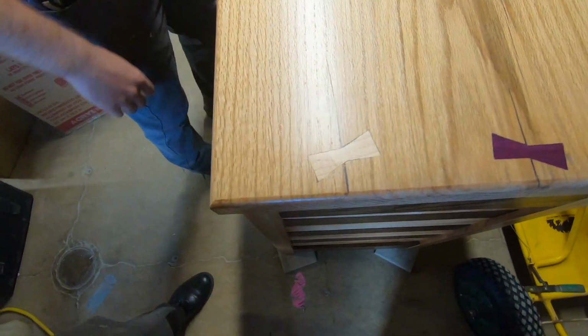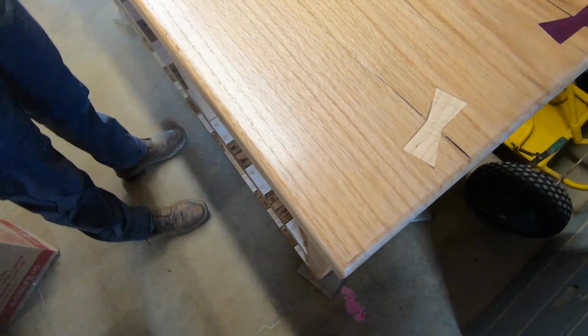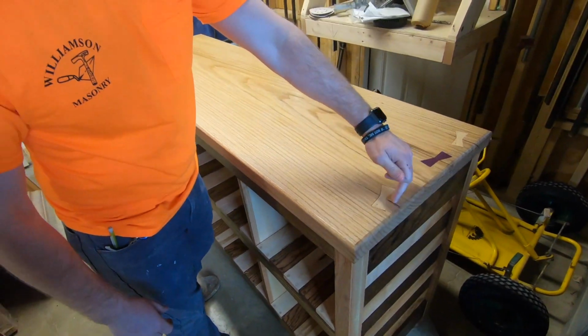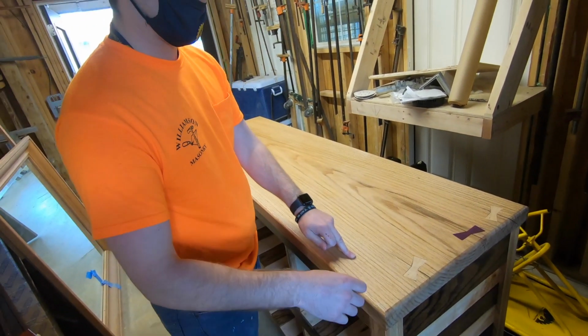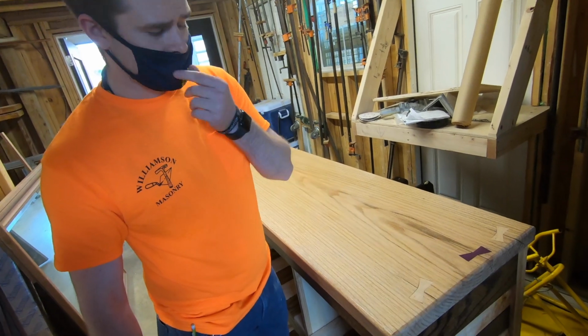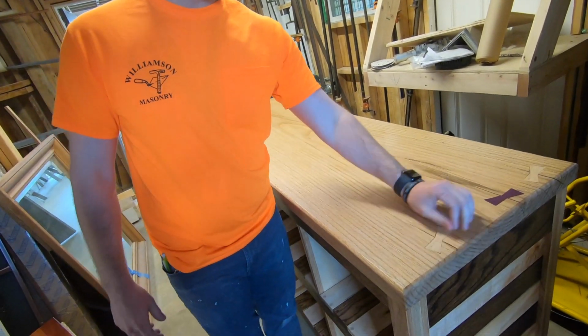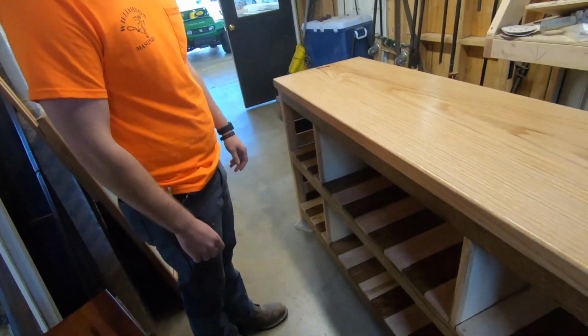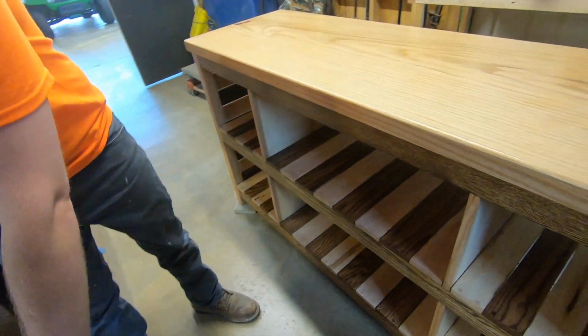That was handmade. You cut that? Handmade dovetail, yep. You have to chisel it out, and use a router so you set the depth correctly. Basically after that, you can keep it a little big because that's not too big of a problem, and then you can just sand it down nice and flush right after. Beautiful. This thing is unbelievable. I love it.